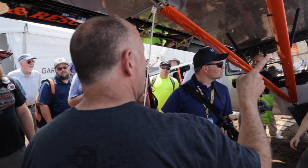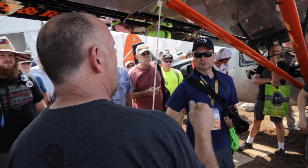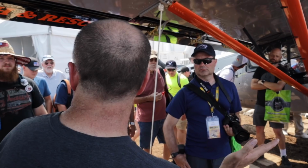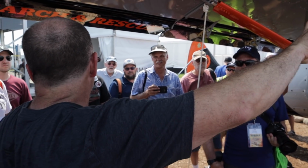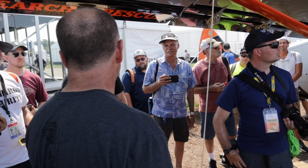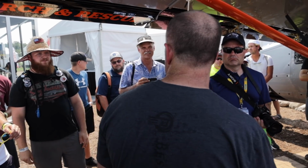With this prop, even if I pitch it steep, once you get into the higher speeds, you have to pull the RPM down from 2550 to 2000 because that wide paddle is not effective at the high end. You'll start getting a vibration. So I don't know its ultimate top speed yet, but I'm learning what I need on the bottom, and then we'll play from there.